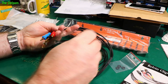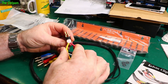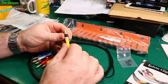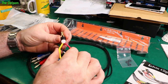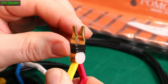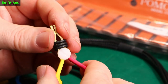It just happens to have an extra wire that passes through as well — which is interesting. The clips are a spring clip design using O-rings as the spring, which is why they include spare ones — eventually they will break. There's a nylon bushing that sits in there and holds them apart, and the O-rings are what causes it to clamp. You can pull them open that way too. The clip does have some little ridges inside for grip. If you took those O-rings off, it would probably just fall apart — simple but effective design.